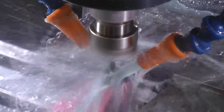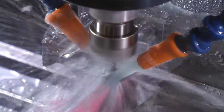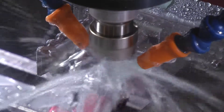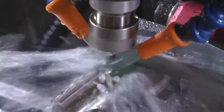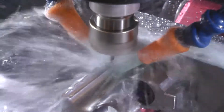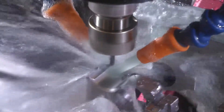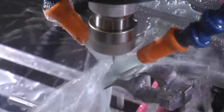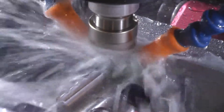After I cut this I realized the cuts didn't seem deep enough. I went back and checked everything and it turned out I had indexed my reference point off of a different reference point than all the previous operations. So I went back and fixed that and redid the cuts to the appropriate depth. That won't be a problem in the future - there's only a problem on this one because this is a sacrificial gas block I'm making, mainly because the bore was off-center. So it's not going to be used - I'm just using it as practice. Right here this relief cut is not cutting deep enough for that same reason.